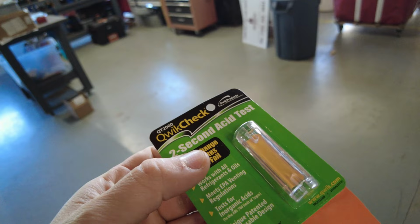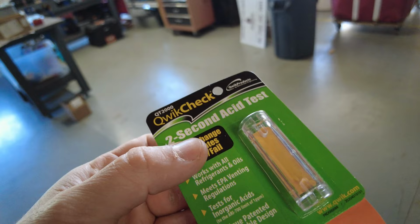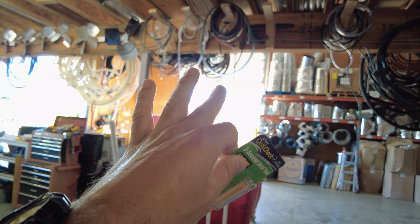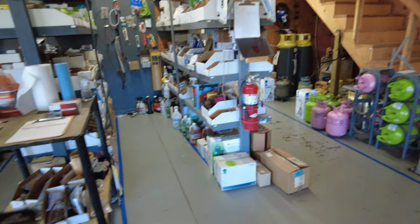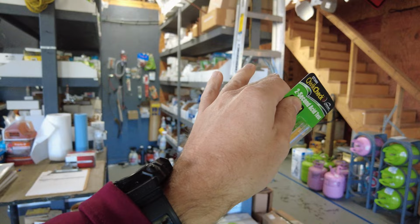It's more of a, hey, what do we do with this refrigerant? You're not reusing it anyways, because the new unit that we're putting in, that's being put on the truck right now, has refrigerant in it, right? But if this has acid in it, we know that tank right there is acid, and we need to decide if we want to put it in that tank. We can put it in that tank, but they'll dock us on our refrigerant when we send it back. Or do we want to send that tank off somewhere else? But I just want to know if it has acid or not.